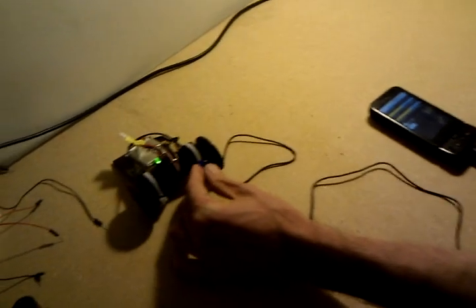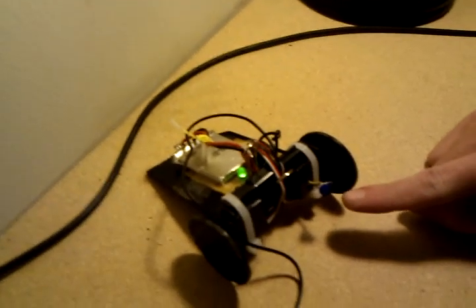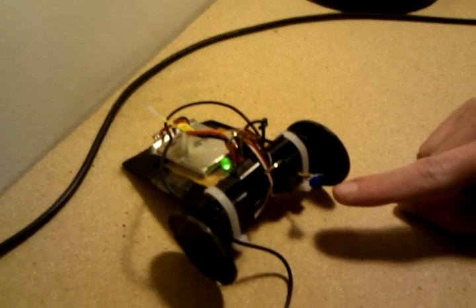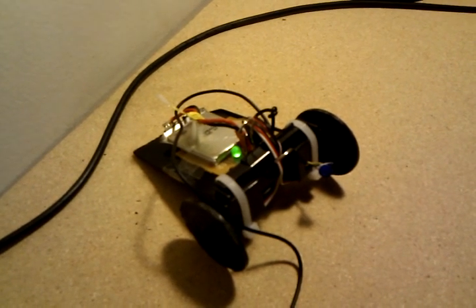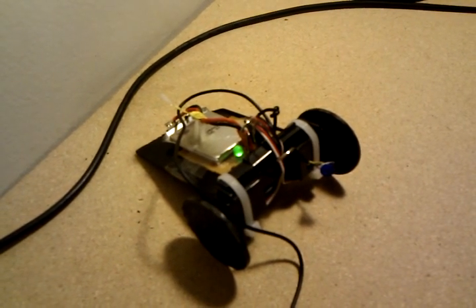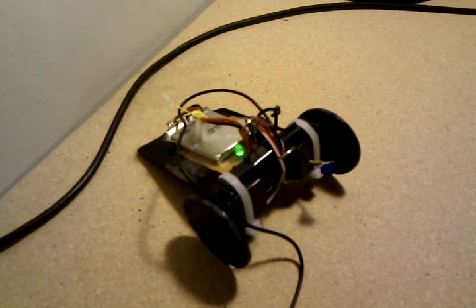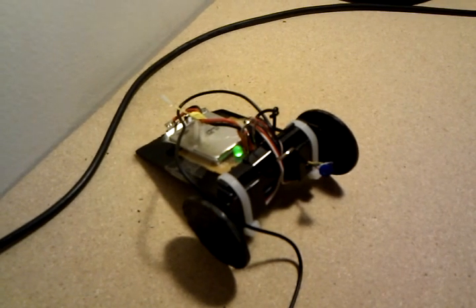You may notice that we used an external potentiometer. This external potentiometer makes life easier for adjusting the zero position of your servo and making both servos go at exactly the same speed. If you modify your servos with an externally adjustable one, then you'll have an easier time. But you don't have to.